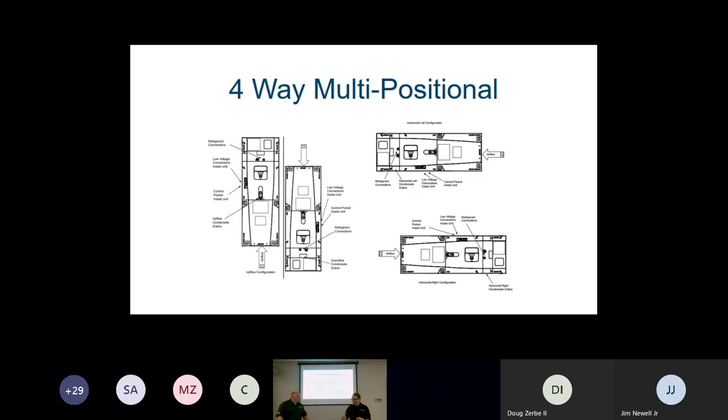So what that means is this: if I were to look at the top of my unit, if I had an 18-inch wide by 18-inch deep hole on the top of that unit, and I'm just throwing a measurement out, I don't want to wind up panning off 4 or 5 inches so that the ductwork comes straight in on the top. That panning now is going to back pressure and raise my static. That air that it's creating has to go somewhere. If it can't go in the ductwork, it's going to leak out the doors. Right. And so you will actually feel more air come out.